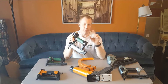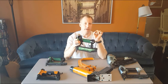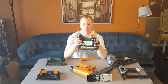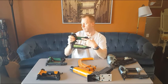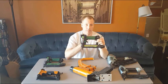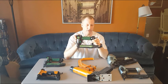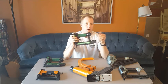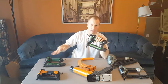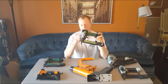I would use the longer brad nailer to install door and window trim — on the drywall side, I need a longer nail to go through the thick part of the casing, through the drywall, and into the framing behind it, getting maybe an inch to an inch-and-a-quarter of nail into the framing. The shorter gun I'd use on the door jamb side. By having both guns with me at the same time, I don't need to swap out nails — that's why I have two basically identical guns.